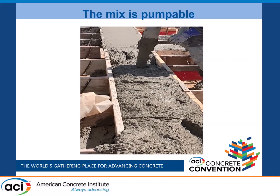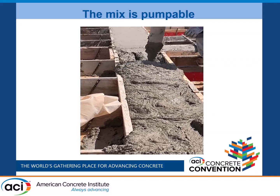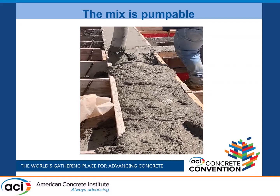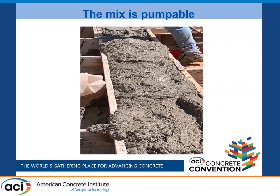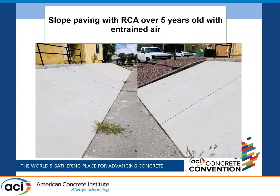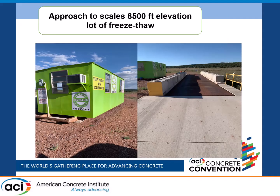We get people that allow us to deliver recycled concrete for driveways, sidewalks, and things like this, but you can't find any architect or engineer that'll buy off on it. These are some slope pavings we did five years ago — perfect concrete. There are no pop-outs, no anything; it's just good looking concrete. These are some scales we did up at 8,500 feet where there are a lot of freeze-thaw cycles, up in the mountain. Been up there about three or four years — absolutely nothing is breaking up, just looks like normal concrete.